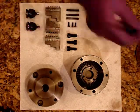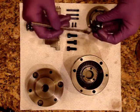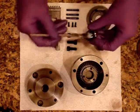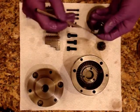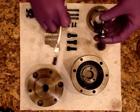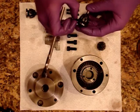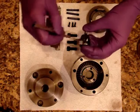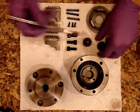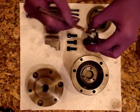It appears this chuck is reversible. I usually just buy two chucks and set up one with the jaws in one orientation, then set up the other one — because it's kind of a nightmare sometimes to change the teeth if you're working on a jaw. You can see there's a groove in here which these long screws kind of index with, and that's what keeps the little pinion here from getting back out. So I want to get some grease down into the track. This finish line grease is pretty good — I use several of their products. I think I might have put this one on the motorcycle chain, but I didn't care for it there. It might work okay here. I believe it's designed to build up a microscopic ceramic coating the more you use it.